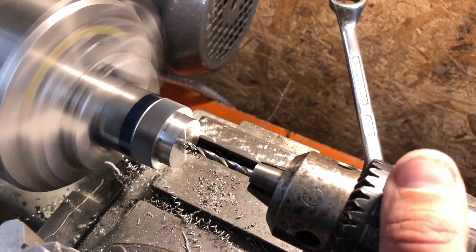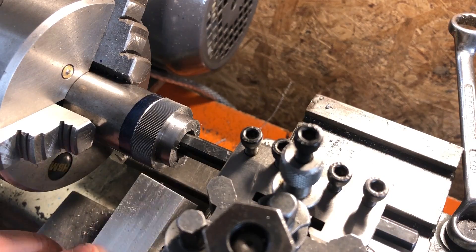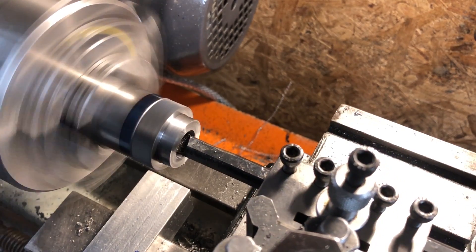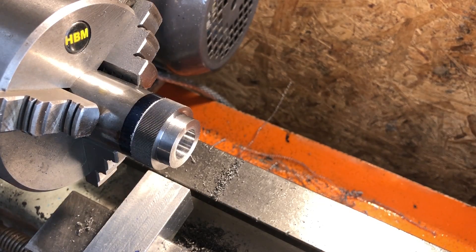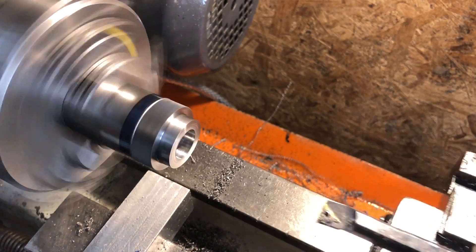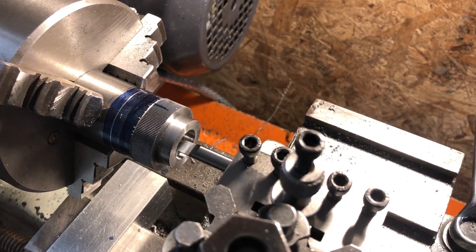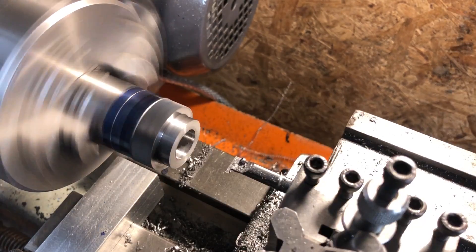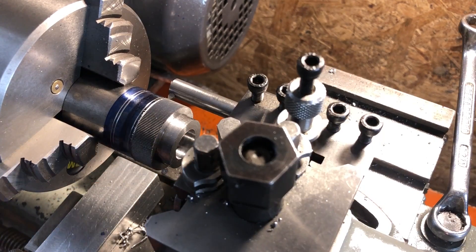As always, I am opening out with a pilot drill, followed by the largest one that I have below my target dimension, and then switching to a boring bar to bring to the final size for threading. This piece of material in the chuck is also going to become the graduated dial for the micro adjuster, so I cannot simply bore all the way through it. Instead, what I am going to do is bore in front of a blind hole, purely to put off thinking about that dial. With the hole to dimension, I can bring my tool up against the carriage stop and create a reference mark on the outside of the part, just to give me a visual of what's going on inside. I can then use this to judge the dimensions of the internal runoff groove, and with that complete and transferred to the outside of the part, setting the carriage stop for the threading tool becomes trivial.